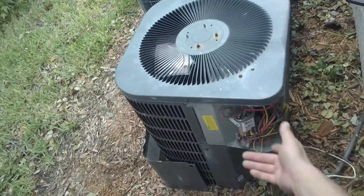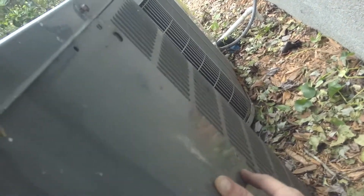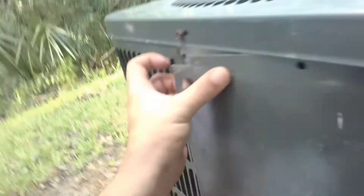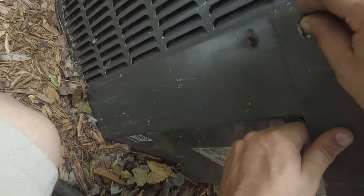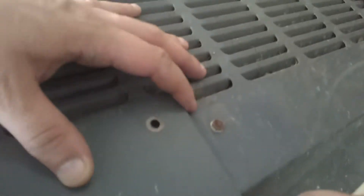It was one of two things — a capacitor or a bad fan motor — at this point, because I could feel the heat coming out of this. The compressor wasn't running and the fan wasn't running when I got here. I pulled this out of the dirt. So, once I pulled that out, I opened the case to see if the contactor was pulled in, and the contactor was pulled in. I said, well, that's gonna pretty much tell me if it's a bad capacitor or a bad contactor, and then nothing was getting power, so I went and got my meter. That's how I diagnosed this one. Probably did some unnecessary steps but in the long run, you get it all taken care of — and that's how you do it.